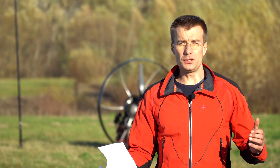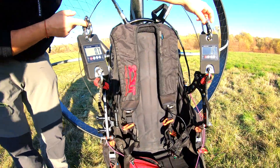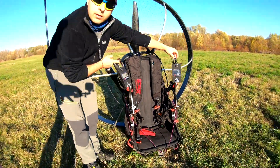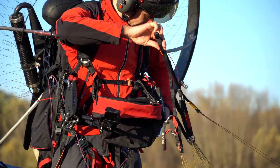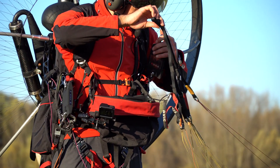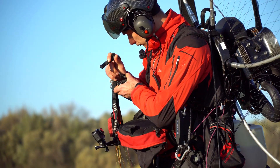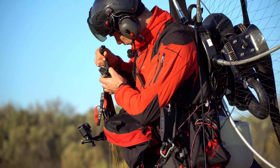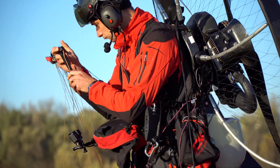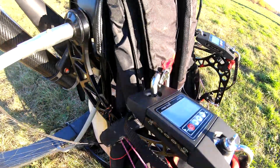In order to measure the torque, we will not hook the glider straight onto the carabiners, but we will hook in two scales — one on the left, one on the right. We will hook the glider into these scales, so the scales will be in between the glider and the carabiners of the paramotor, measuring how much each side is loaded in the air. So when I fly straight with throttle off, I expect both scales to measure the same values.